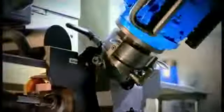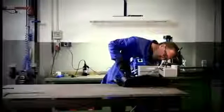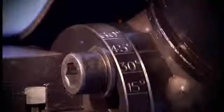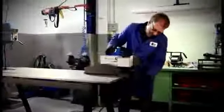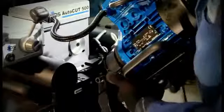Now move the machine back into the cutting area and adjust the desired milling angle. The chip protection is pushed up and the chip container is inserted. With the motor running, we now approach the edge of the material by slowly and carefully rotating the feed ring in the CCW direction by means of the three handles.